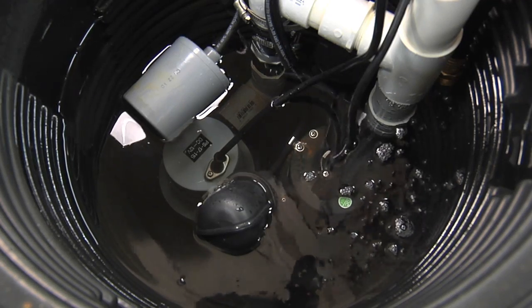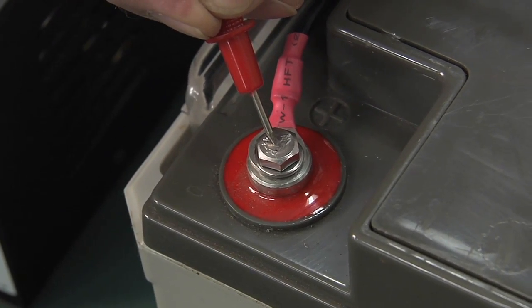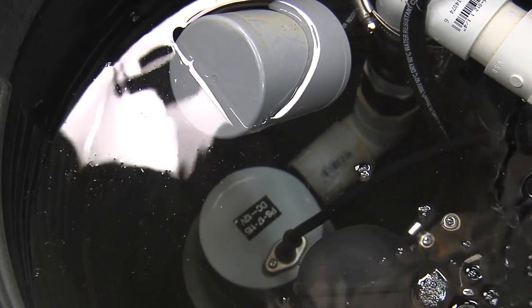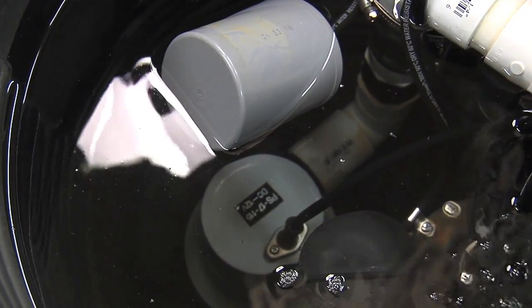The charger is unplugged and now we're going to put a load on it. We're putting water into the sump, and we'll measure the voltage under load so that we can see if the battery voltage stays fairly constant and doesn't drop too much when it starts to pump. You can hear the sump pump turned on — it's running and it's pumping water.